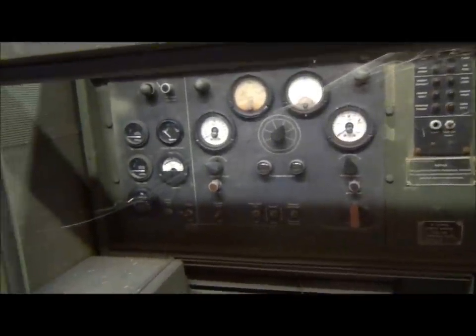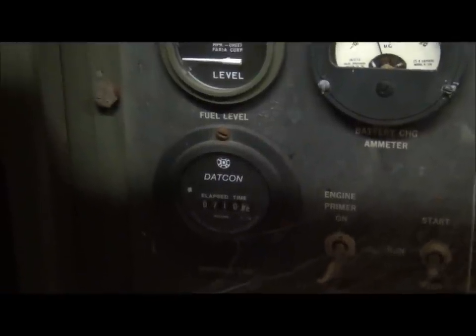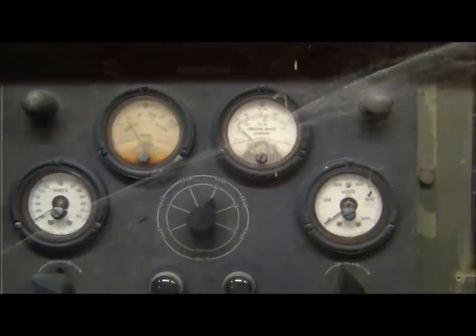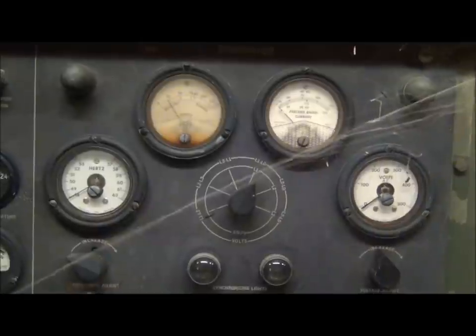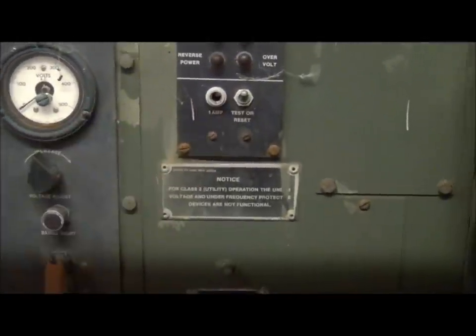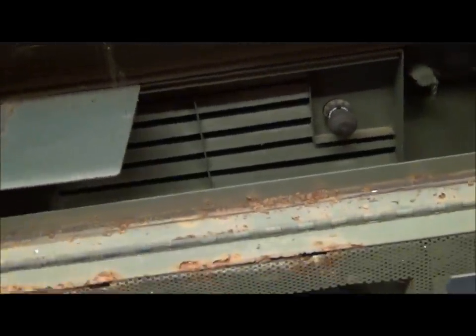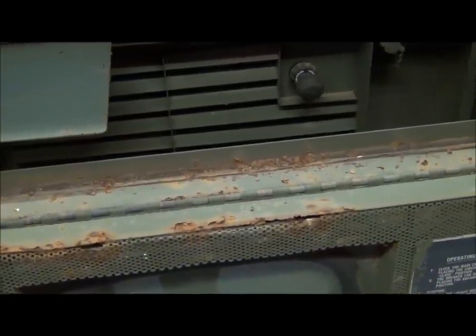We've got quite a few cobwebs in here. This set has about 710 hours on it — it's a nice low-hour set. All the gauges look like they're in fairly good shape, but our percent power meter and percent rated current meter both look like they've got some water in them. They don't look damaged but definitely not a hundred percent, so we may be doing some work on those. We've got a fuse missing from our alarm panel that I'll have to track down. The throttle cable is in place. There's a little bit of rust inside this door but I can paint some rust converter on it and repaint it and it'll be just fine.